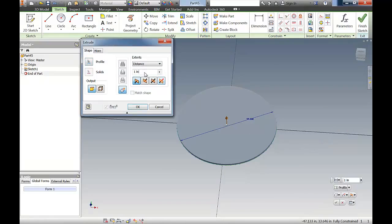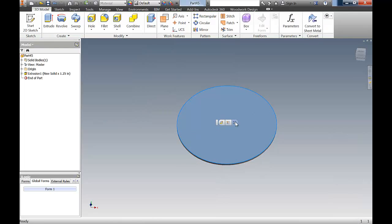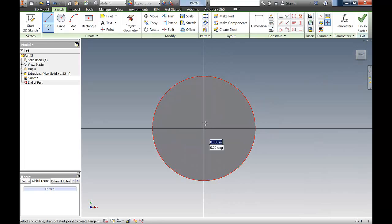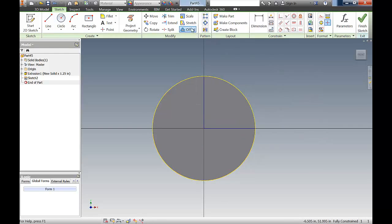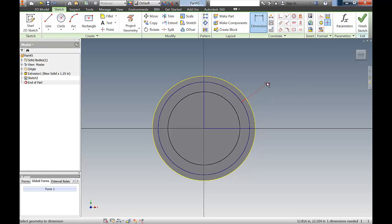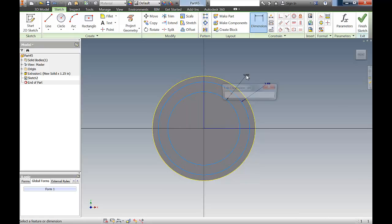You'll also notice that when we start working with dimensional information, I'm usually using some form of a parameter like tabletop thickness or table diameter. The reason for that is whenever you start a job, it's going to change. The more control of variability that you put into the model, the easier it is to manipulate it after the fact. I've never seen a job start and finish and have no changes to it.